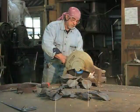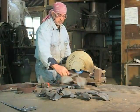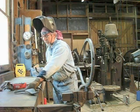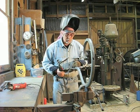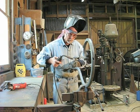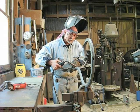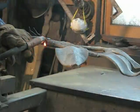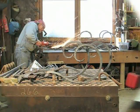Here we are cutting off these individual sections, and they will be attached to one single arm of the chandelier. You have to be really careful in doing this work because the welding is to a very thick member, and the other side is a very thin member — the tube steel. I like leaving in just about an eighth of an inch gap before I fill in the welds. That way, I'm sure that I get complete penetration.